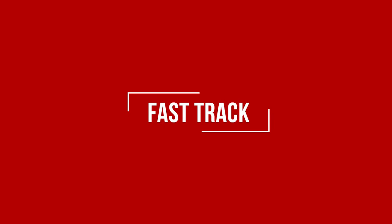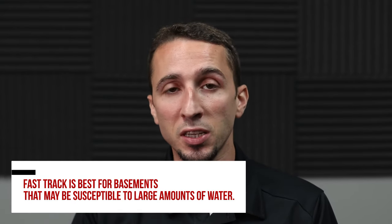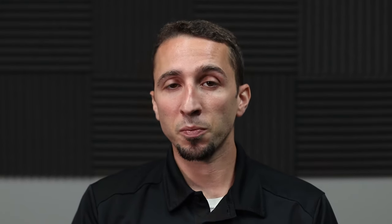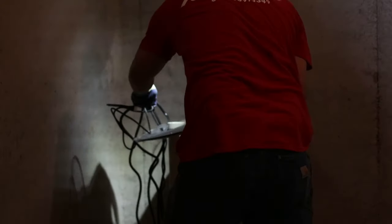The last option is a product called Fast Track. This is a larger drainage tile used to move large amounts of water to the sump system. It's a good product for cases where you have a flood outside and experience an excessive amount of water you didn't plan for. This drainage tile sits beside the footing, and more concrete needs to be removed — usually about 10 inches — to get the tile underneath the floor. Once installed all the way around the perimeter, and sometimes throughout the middle of the basement floor, it empties out into a sump pump — sometimes more than one — and drives the water out of the house.